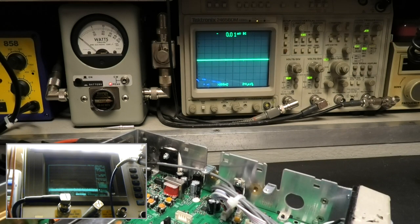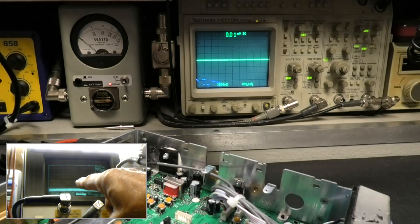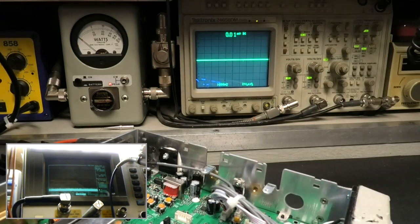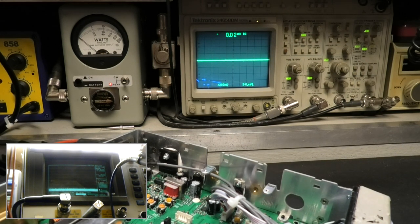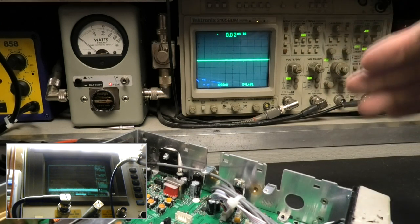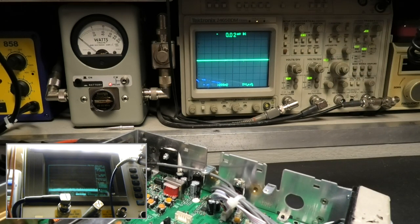If you can't do that, you're going to be splattering to adjacent channels. You're going to be detuning or misaligning the radio. It's inevitable. It's a fact. There's no way around it. If you made it this far, I'm glad. If you don't have a calibrated scope, you cannot tune AM. Forget it. You're going to get it close, but you're not going to get it. You could be under-modulated, over-modulated, or not even the modulation. What you're going to get is the power ratio is incorrect. You're going to see that in a minute.